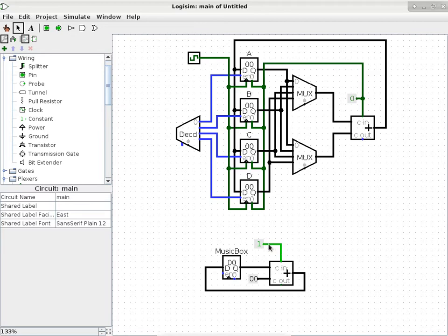And we also want this register to be always enabled. Okay, this looks ugly, but it works. There we go. And we want to make sure it is turned off. It's not being reset, so we want to bring this 0 to make sure that we are not resetting the register. And then the clock line of this particular register connects to the global clock line.